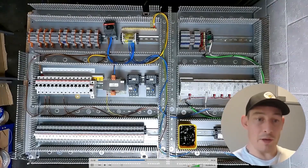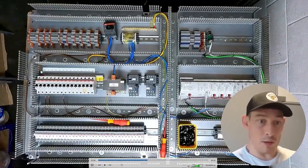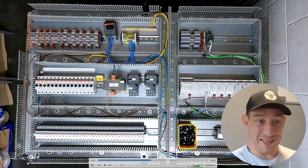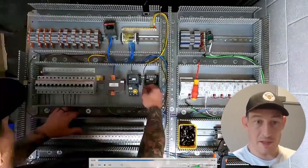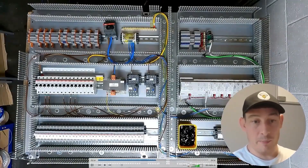This is also the point I realized I need to shift the MCBs along and add an additional breaker for the 24 volt AC coming out of the transformer, so I've just done that. Next bit is wiring the MCBs to the contactor overloads — main supplies to the contactor and overloads.